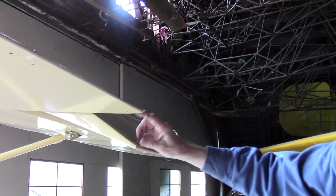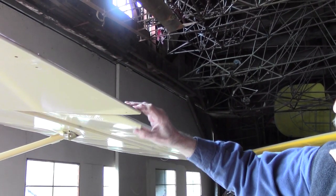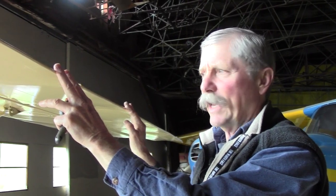You can see that's a little bit less travel in the down position — that's where you want your travel to be. I rig these typically at neutral. I know a lot of people rig them slightly down with a little bit of droop, but neutral seems to work extremely well with the Interstate setup the way they have it. So go ahead and rig them neutral and that'll work fine.